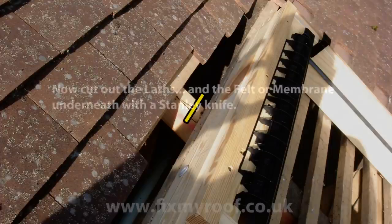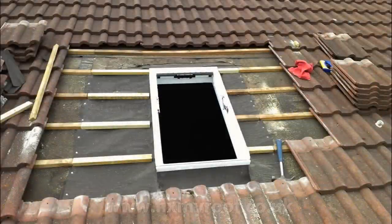At this stage, it's a good idea to gently fold back the under-tile felt or membrane out of the way to avoid any damage. This way you can re-fit the felt around the window if you haven't damaged it. If it's ripped or damaged, don't worry — you can always fit some felt in later by slipping it underneath the laths before nailing the laths back down, as pictured here. Please note, this was not necessary in our video, as another contractor was insulating internally at a later stage.